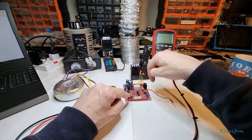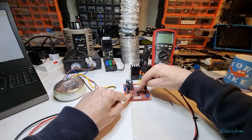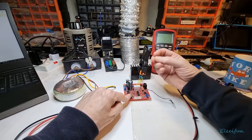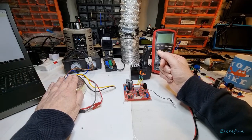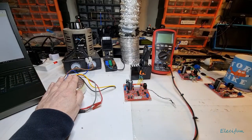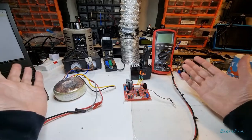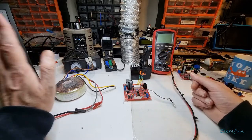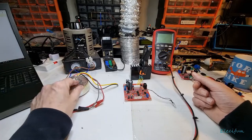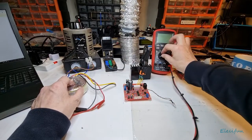These components all require a little bit of juice just for themselves. So if you were to be really strict - 90 VA - and then try to get 90 watts out of it, you want the ideal thing and it's not going to work like that. You don't want to go any higher than 24 volts input. I'm going to show you something now that might startle you. This is my AC supply and we're going to measure it. I've got the two middle wires joined here because this is a two 12-volt output transformer.